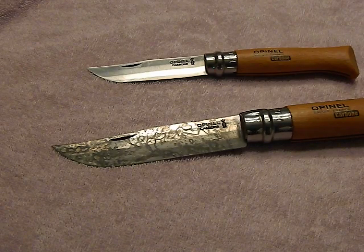So when you look at this, guys, at the $10 range, you're not going to find any better performance than this. I don't care what knife it is, if it's stainless steel, it's not going to outperform this. And in that $10 to $20 range, it's mostly going to be 3CR13 steel, which is pretty much garbage. 440A, 440B, that 420J2, all those really super soft stainless steels, which when you sharpen them can barely take a shaving edge. Barely. You really got to work at it because they're such soft and difficult steels to work with.